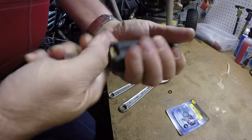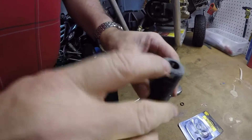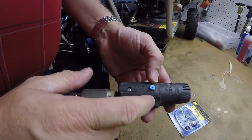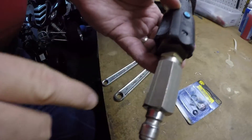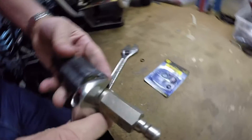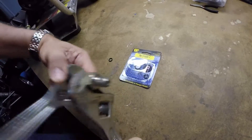The best thing to do is unscrew it, hold on to the base, and unscrew it so it rattles. If it rattles, it should spin for you and should be working fine. You may have to rebuild these nozzles sometimes, but the first thing you want to do on this particular one is check the high-pressure filter on the back, which helps extend the life of the nozzle. We're going to open up this filter and see if it needs to be cleaned.